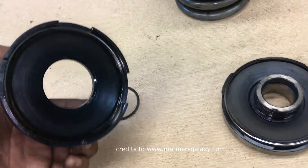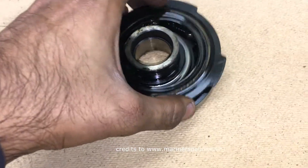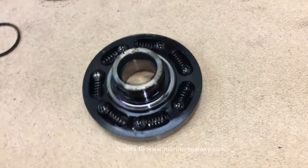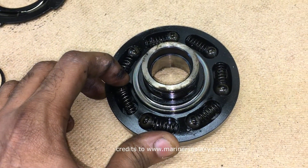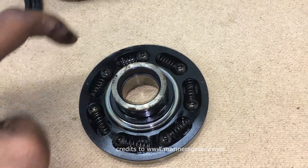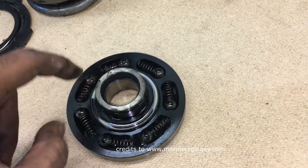I have already opened this one to show you the parts inside. These are the plates which support the bearings. This is the roto cap of the inlet valve — you see the spring-loaded steel balls inside. When the valve is compressed or opened, these springs get charged because of the downward force, and when the spindle goes up there is a releasing force that gives a turning effect. All these balls are arranged at a circular angle so they produce a complete turning effect.